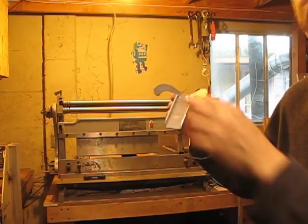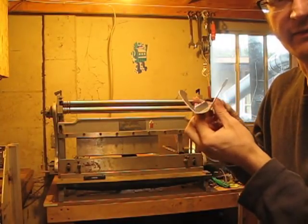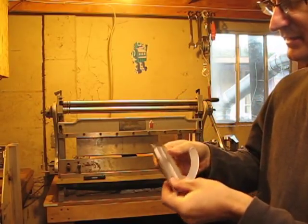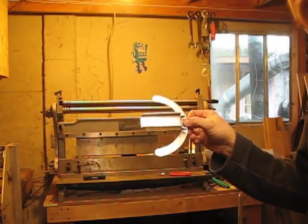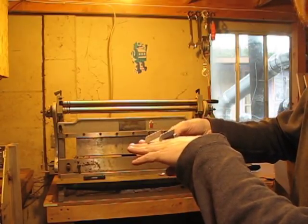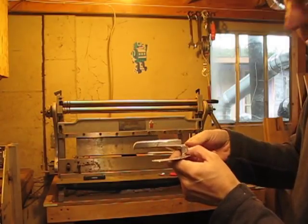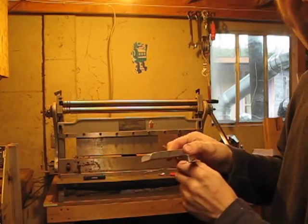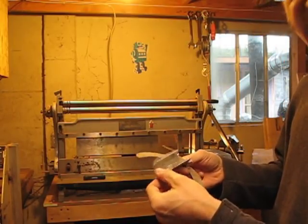I have the first set of bends made along here. Even though the die wasn't coming down on these edges, it still bent them, so I'm going to straighten that back out in my vise and then make the final two bends. I have my final piece now, shaped like this — it will attach right underneath this piece. I've bent this to keep it as strong as possible since I can only support it from one side. This is about 0.075 inch thick 5052 aluminum, so it should be stiff enough for this application.